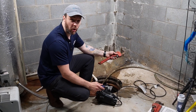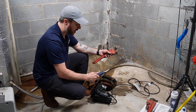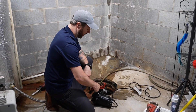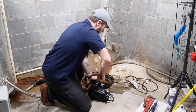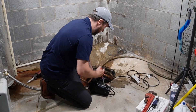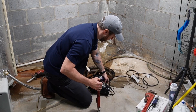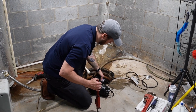If this was a normal reinstall and everything was actually piped right, you can get away with just having a nut driver to undo whatever check valve is available, unless it's one of the fancy PVC union ones. Then you could wrench out the MIP from the old pump using a pipe wrench and work that loose. In my experience these should come out pretty easy — there shouldn't really be any Teflon tape, pipe dope, or sealant on the MIP going into the sump, so it should be nice and easy to squeeze out.